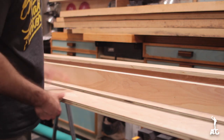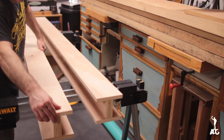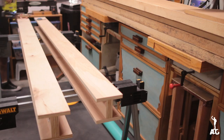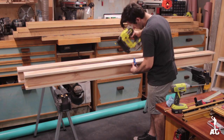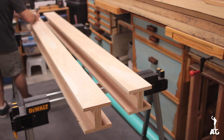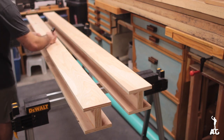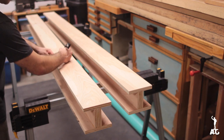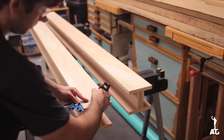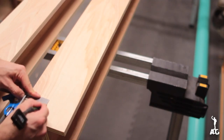Because the plans called for a taller middle piece, equal in width with the top and bottom of the beams, it is important to remember not to make your middle part narrower, because that's what gives the beam strength. I think the thicker the middle part is, the less chance for the beam under considerable amount of duty will warp or bow.